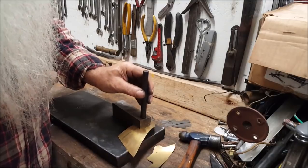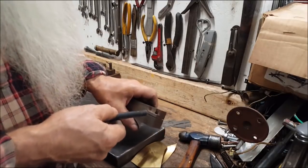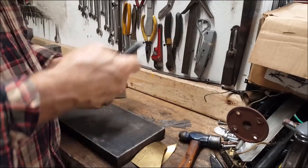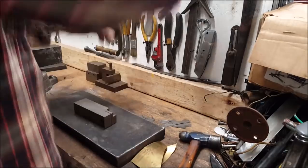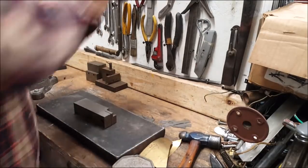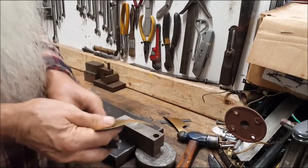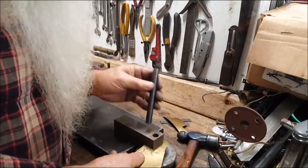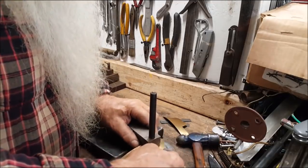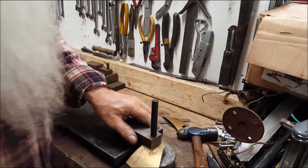And that hole right there is a precise fit. It's perfect. It's a perfect sliding fit right there. And the way this works is it just shears. When I sawed that slot in there, slide that in there, then this just shears the hole up. This is the way the thing works. You'd be well advised to build yourself one. And you just hold a little pressure down on it like that and give it a sharp blow. And now we got a hole in that.